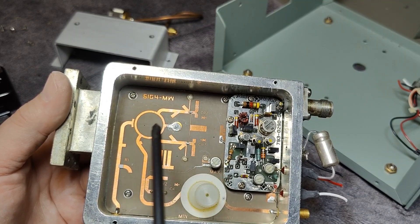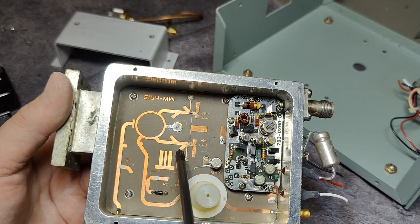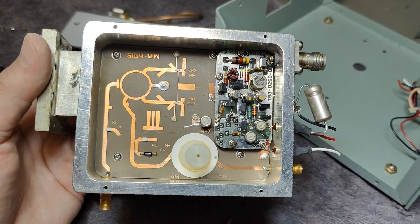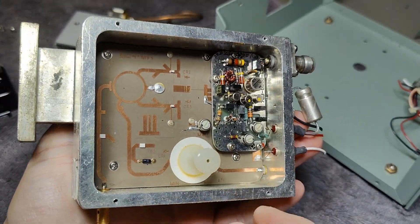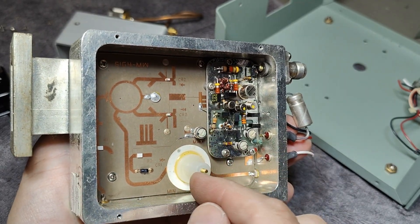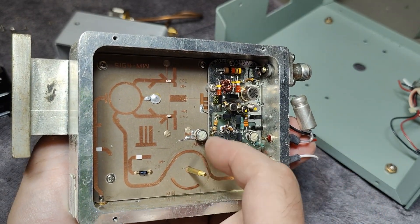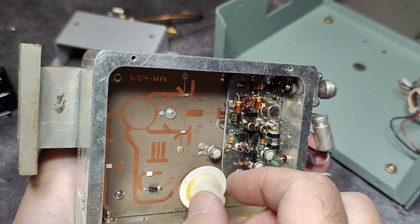All the dimensions you see here are designed for 6 GHz. This diode here is a level detector of the local oscillator — how much input you have. And there's another really cool thing about this part here: the idea is you rotate this little part, and there is a ceramic substrate with a little coupler. When you rotate it, you can vary the coupling — there's a minimum — so this is a little variable attenuator. Amazing.